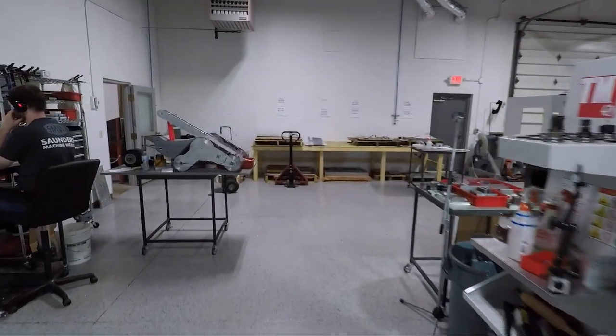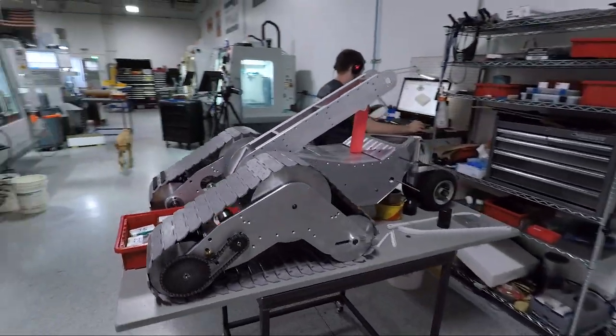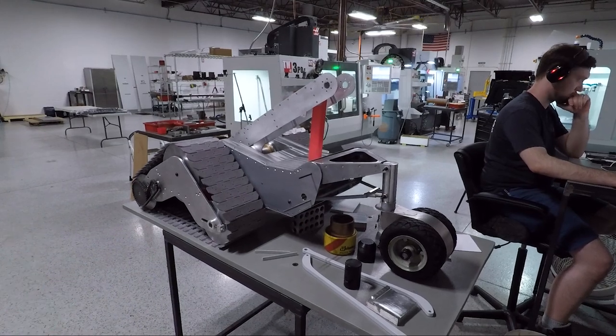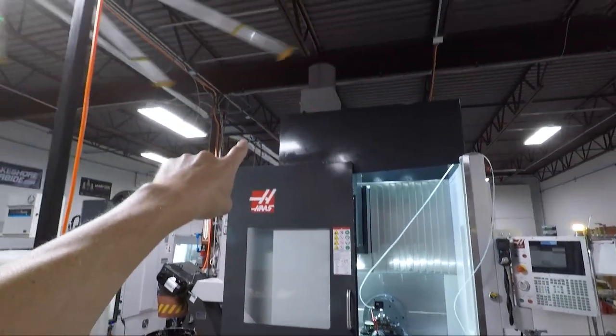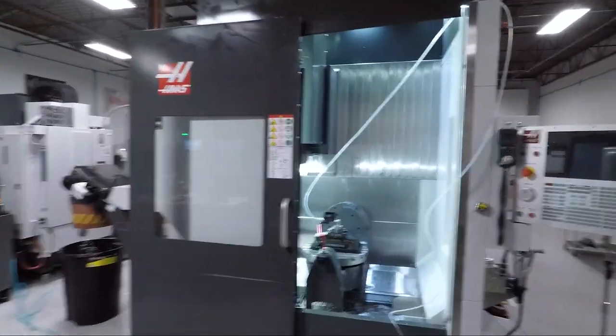Ed is working on Johnny Five. Johnny Five is taking a couple-week break because we have another pretty cool project in the works that you're going to hear about in about three or four weeks. We've honestly got a lot of the bigger, harder parts done. We finally pulled the trigger on our air conditioning system. Air conditioning systems are a lot more complicated than I had originally realized. We're going with a 10-ton dual-stage system. We do have to have a minor amount of reinforcements done, and it'll also heat, so we need a gas line and electric run to it. Hopefully it'll be installed in the next few weeks — great for worker comfort, tolerances, machine condition, and humidity.